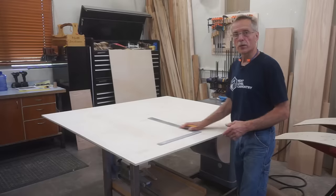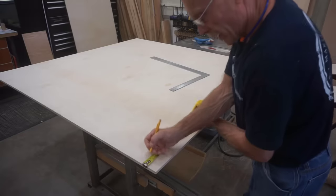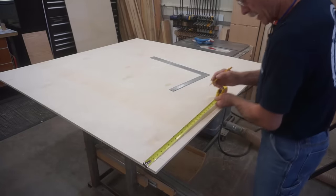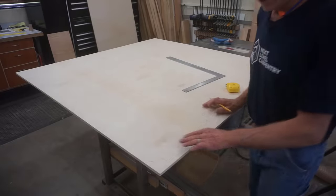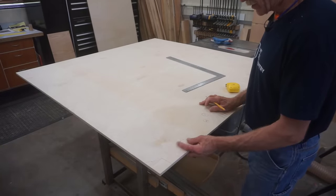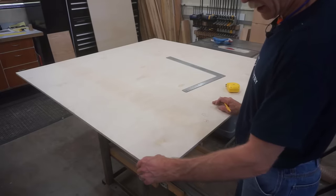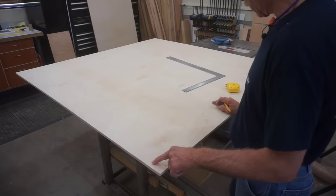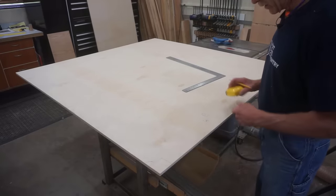I've got plenty to work with for these 14 and 3 quarter inch pieces. So I'll start out leaving about an inch waste on that side, 15 and 3 quarters to a saw kerf here. On some projects, the difference between using two sheets and three is a matter of saw kerf placement. So I've got to really dial these things in. And it's pretty extravagant to leave that much trimming on the edge. But in this case, I've got plenty, so I don't have to stress about it.